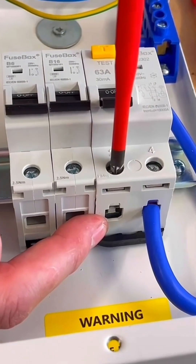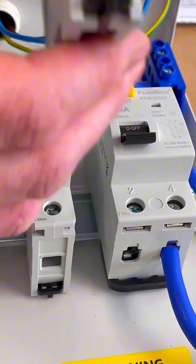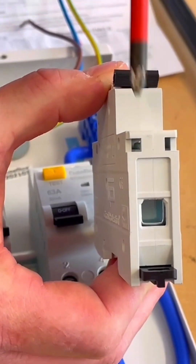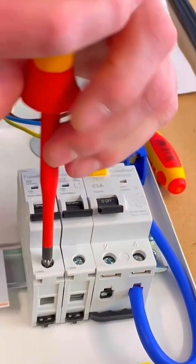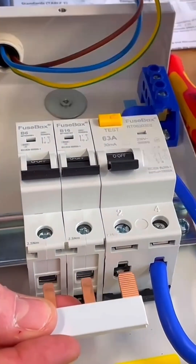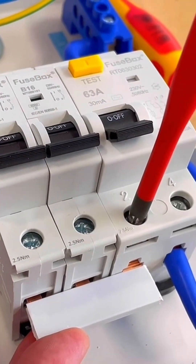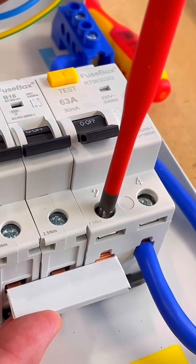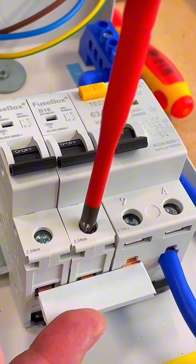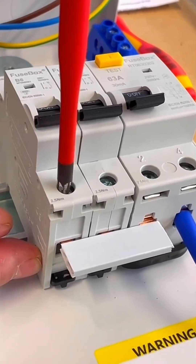Make sure that's in position. You'll notice one end of the bus bar is slightly larger than the other two — that's the one that goes into the RCCB. We've got to open up that screw and the cage clamp underneath. If I pop a breaker back out so you can have a look — you should also open out the bottom cage clamps for the same connection. It's important they're open. Once opened, they will be able to take the bus bar. Fit it in and go all the way into position, and you should feel it come up and connect.